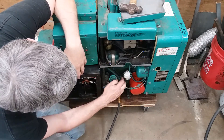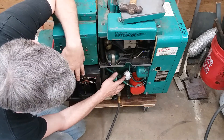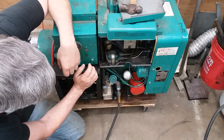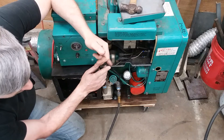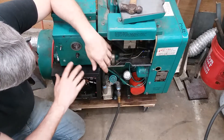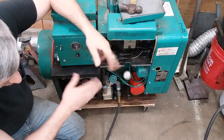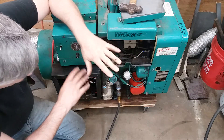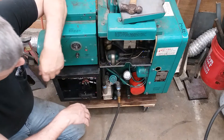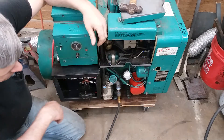Here's your oil pressure gauge and your oil pressure switch. Eventually this is going to be replaced with electronic controls. I don't trust the mechanical controls on this. There is no runaway protection at all - if this thing locks wide open it's just going to turn into a grenade. There's also no over-frequency, under-frequency, or over-crank protection. This requires attention at all times, and I want to use it for home standby so I want it to run automatically. That way if I'm on the road and the power goes out, my wife doesn't have to deal with it.